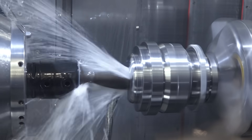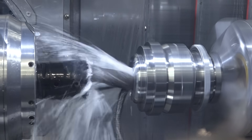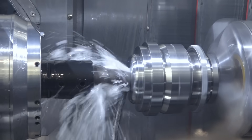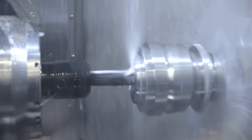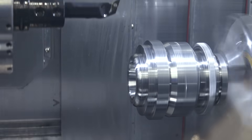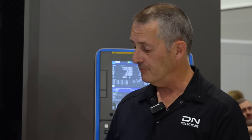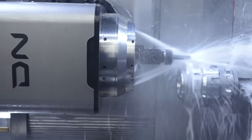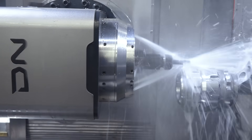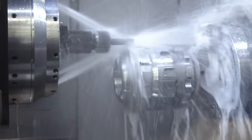For anyone considering a Mill-Turn, here's why you might want to consider one. Basically, this machine — work envelope. You don't have two turrets, you don't have a lot of clearance issues between them. You're limited to your max cutting diameter because of the turrets, and the physical structure doesn't move far enough out before you have issues. But this machine is all wide open. You have one tool only. You don't have to worry about adjacent tool interference. You put the tools in the magazine, they go into the spindle and cut one at a time, just like a milling machine.